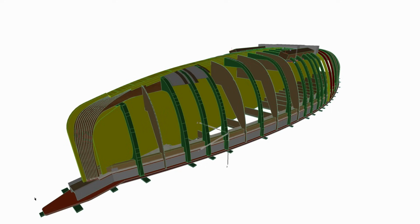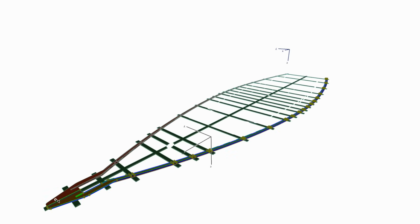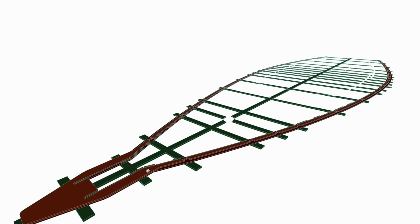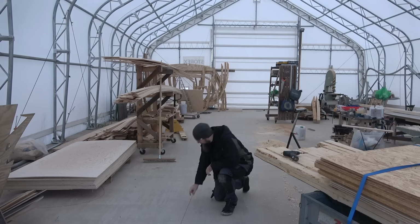And the very first pieces that will be laid to the floor are these: the foundation boards, and these are the bulwark pieces, 2 layers of 15mm plywood. So this is the middle line of the boat, this string right here.